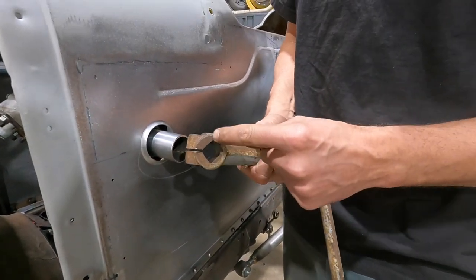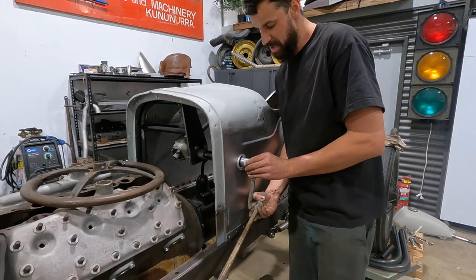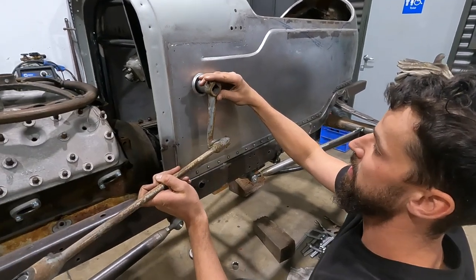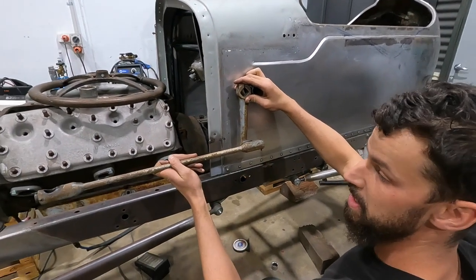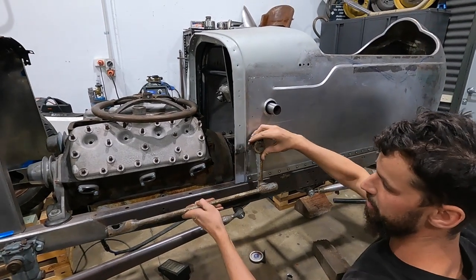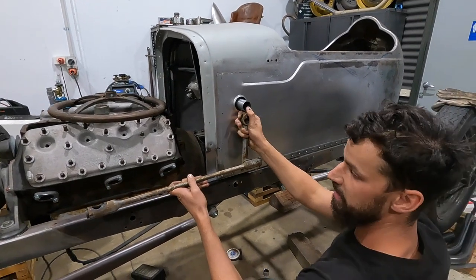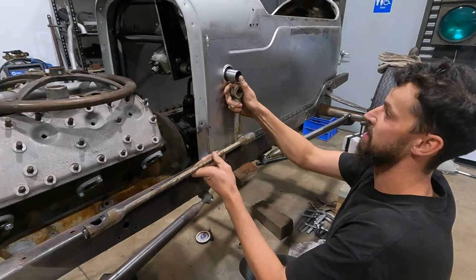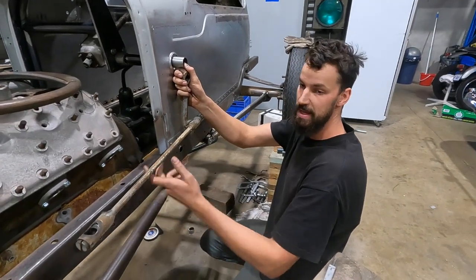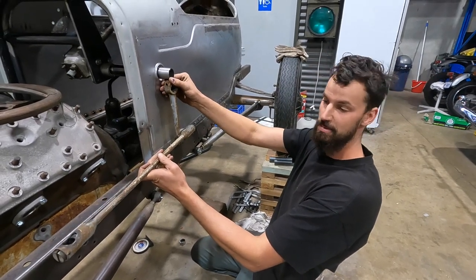Man, it would be nice to even mill that out and just slide it on over and weld it. Make it look like it's totally factory. That's what we're trying to achieve for the steering. It will sit obviously a little bit closer, and then I'll end up doing a little bit of a dip with this drag link to make sure that it is parallel with the frame. You always want your drag links to be parallel. So that'll go like that. That'll travel all the way to the front, bolt on. I'll just cut this, we'll sleeve it, and rebuild both ends. Got a rebuild kit for them both, so that's gonna be it. Cowl steer, all day long, baby.